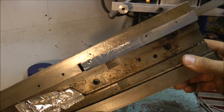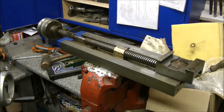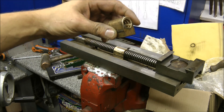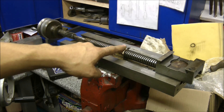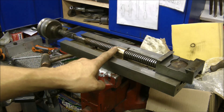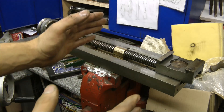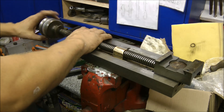Let's get this thing bolted back together. I've reassembled the cross slide — it was just a simple job of re-bolting this brass nut on. The original had a lovely rounded shape, and I found, to my dismay, when I tried this one in the lathe, because it was flat and slightly higher it actually hit the body of the lathe. I don't know why they didn't make it like the original one. Anyway, I've just filed a little bit off and it fits a treat. I just need to locate this to the end, and that gave me the room to get it to the back of the lathe, because there are splash plates in the way, so I can pull it forward onto the body of the lathe.